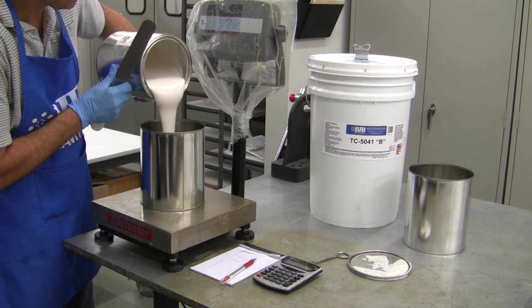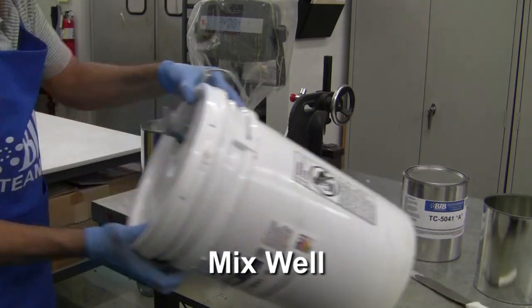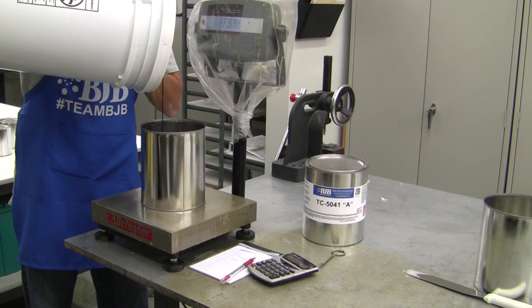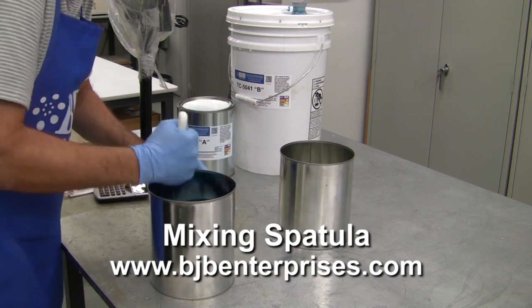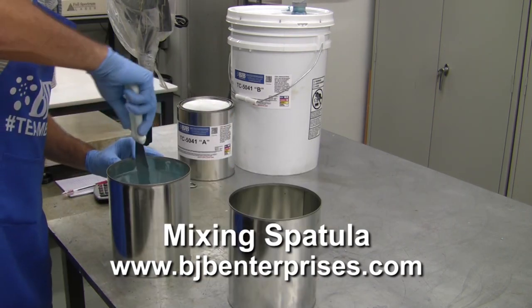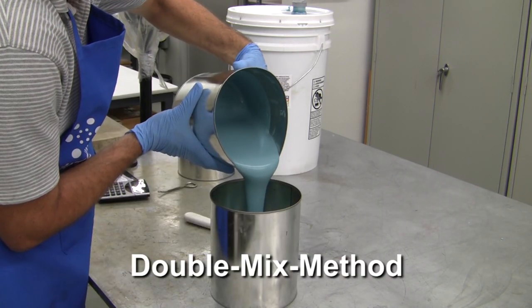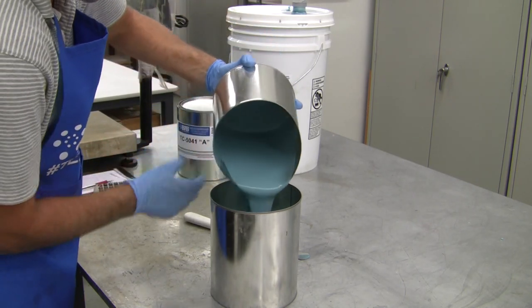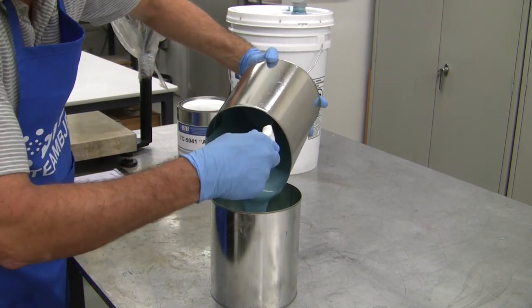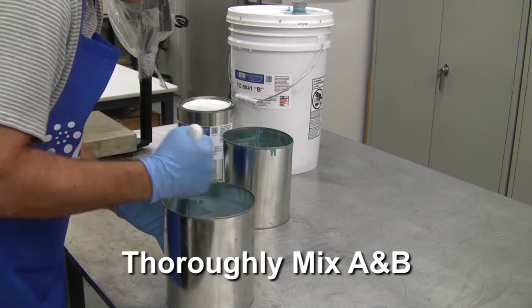The A side of our silicone is dispensed into our mixing container. The low viscosity B side is shaken prior to pouring to ensure a homogenous blend. After the correct amount of B side is added to the A, we can begin mixing thoroughly with our mixing spatula. These reusable spatulas do a great job and are available on our website. As mentioned in our other mold tutorials, we use the double mix method of transferring the first mix into a new container to ensure streaks of unmixed silicone don't make it into the mold. The cost of an extra container is nothing compared to a ruined mold. Once the silicone is transferred, we give the batch another good mix.